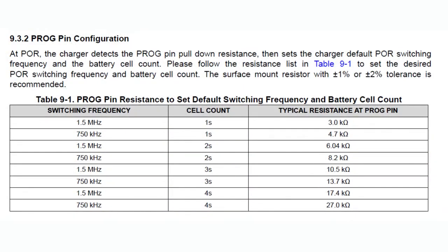The chip has a standalone mode with an i-limit pin and a prog pin. By picking a certain resistor value you hard-code in the number of cells. It's 4.2 volts per cell, so one cell is 4.2V, two cells is about 8.4V, up to 16.8V for 4S. I tend to use single-cell configurations the most, but I've noticed a lot of people doing robotics or drones tend to use 2S or 3S cells, so this would be perfect for them.